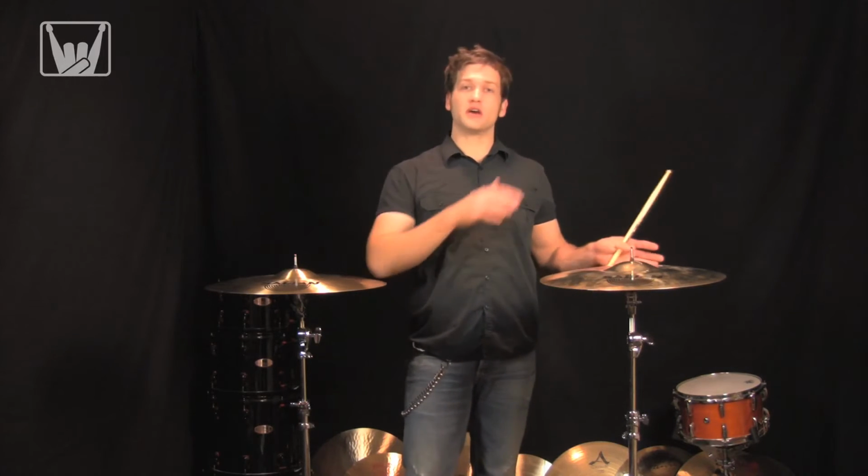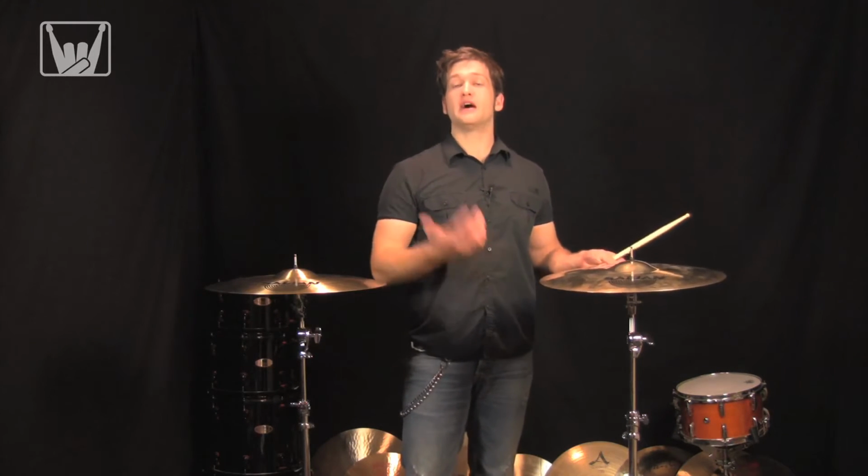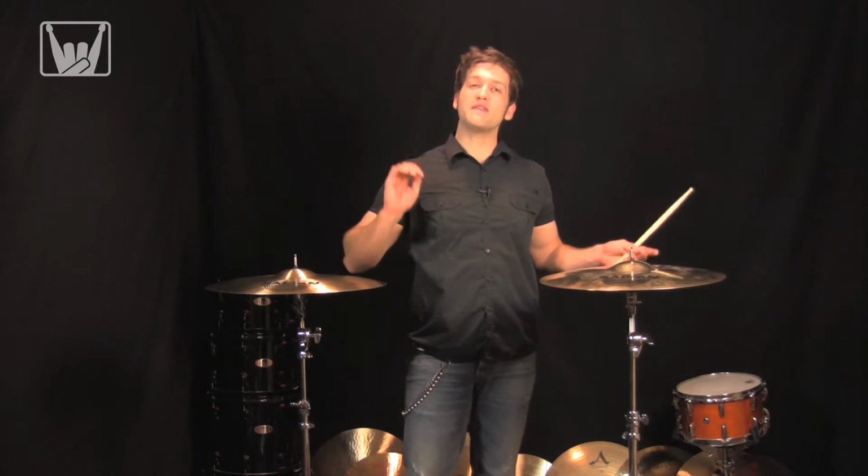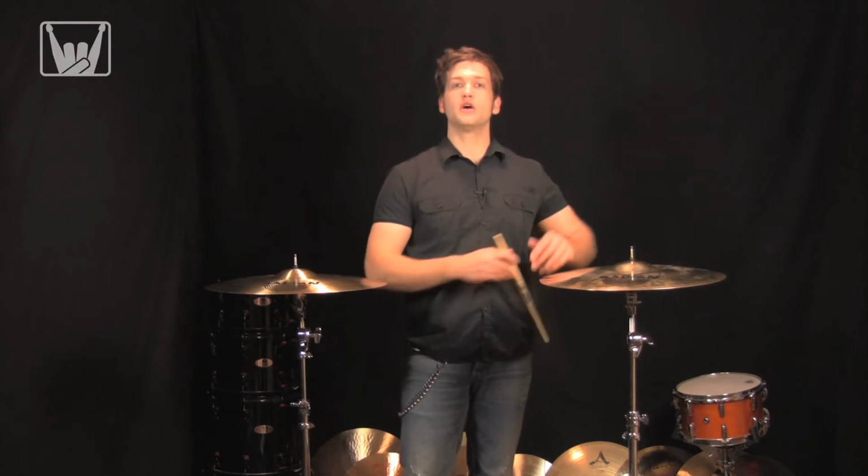As it removes the material, it leaves those grooves that you feel in the cymbal. Now, all the sound in the cymbal starts at the bell. As it works its way out, the sound wave has to go through those notches in the cymbal. So, the way you space the lathing marks in a cymbal affects the way it both opens and closes and affects the overall tone in the cymbal.